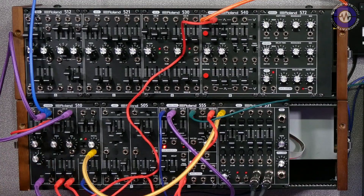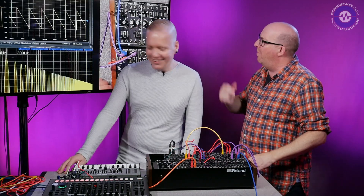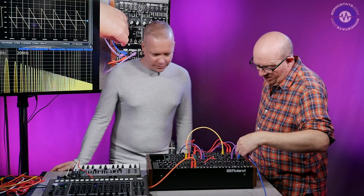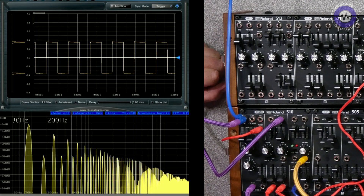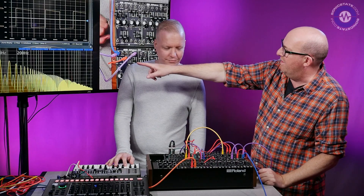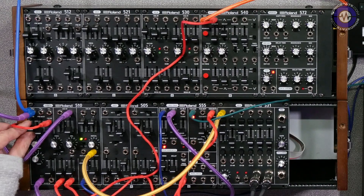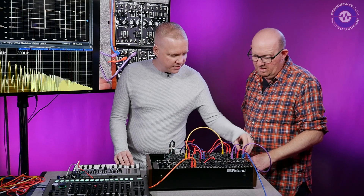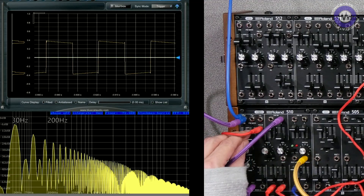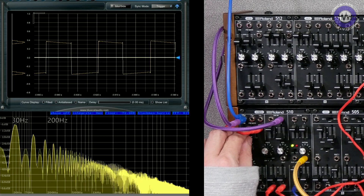I know we've got the scope — you're probably not going to pick this up on YouTube, but there's quite a lot of depth going on there. We were listening to the square wave, correct. So if I plug that in, the square wave — and if you play a note, we're listening to a D. We can see the fundamental is super low — down at 30 hertz. So we've got plenty of bottom end. And the shape — is there pulse width? Yes, of course. So we have the pulse width setting here, and we can modulate that. So here's the modulation depth, and we're taking that from an LFO — from the 555 utility module — just a basic triangle wave.